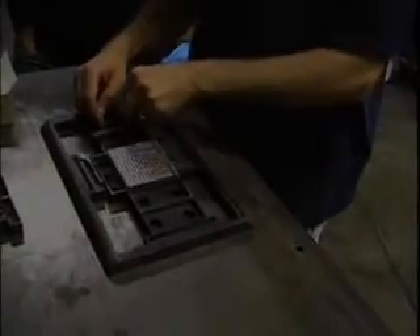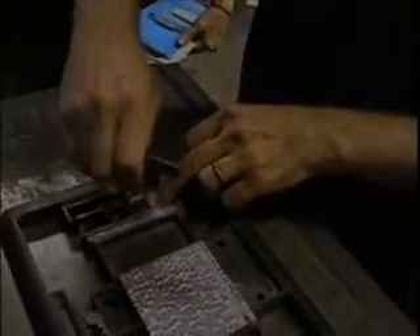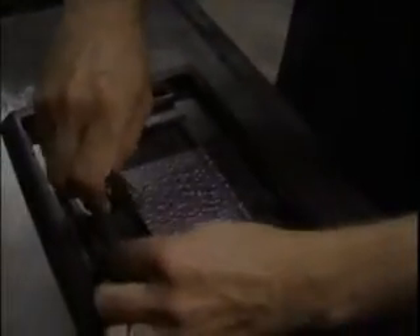Just to take up a little more space. I sort of snug them up by hand first. Those are the quoins — they're a pair of wedges and they've got this gear mechanism in them, with a matching gear. You use that just to tighten — this is not the right key for these quoins, because the teeth are different, it's the wrong size. But that's the basic idea — it just helps tighten up the wedges. And once everything is tight, you can pick up the whole assembly and nothing falls out. And then this goes in the press — this is the chase for that press.